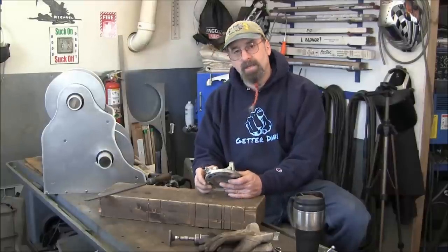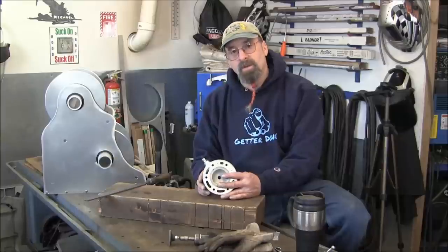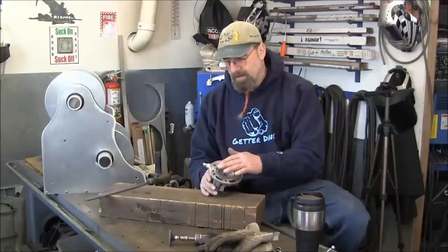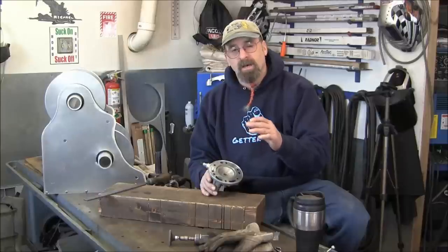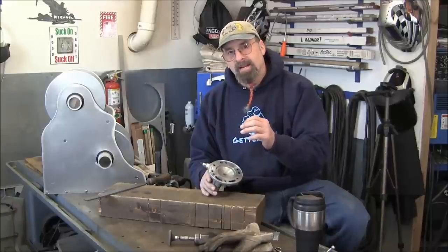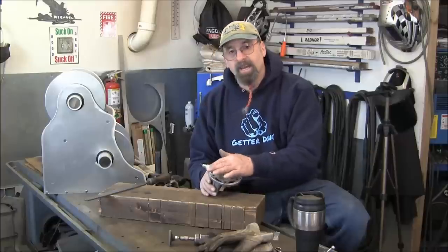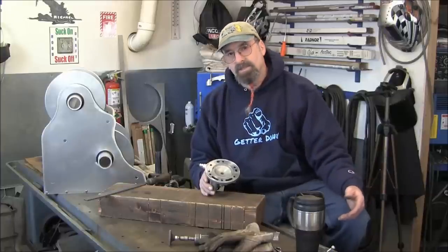And this was a pretty nice piece to actually weld on, and once we did get in there, it was good material. You can see the machining and how close, and you can see why I like that 46-43 rod to build up on. When I started repairing O-ring grooves on a cylindrical spool distributing system and came back and machined it afterwards, those little dividers between the O-rings were standing up proud and blending in really nice, I knew this was a good rod. That was a job that I had 5-6 years ago.